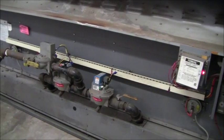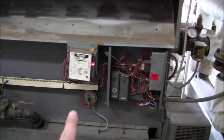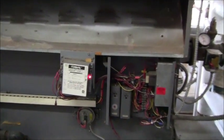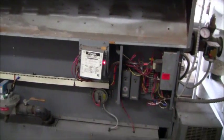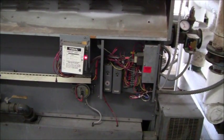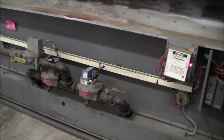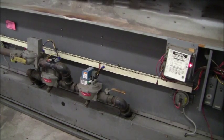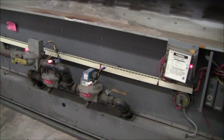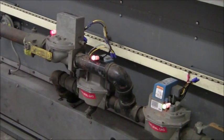You can see that the lights are off on the gas valves. The boiler control still has its light on, telling me there's still a call for hot water, so the boiler should come back on. After we go through a startup sequence and the natural gas is back on, we'll continue to test the low water cutout again. The gas valves just opened up — the boiler is back in service.